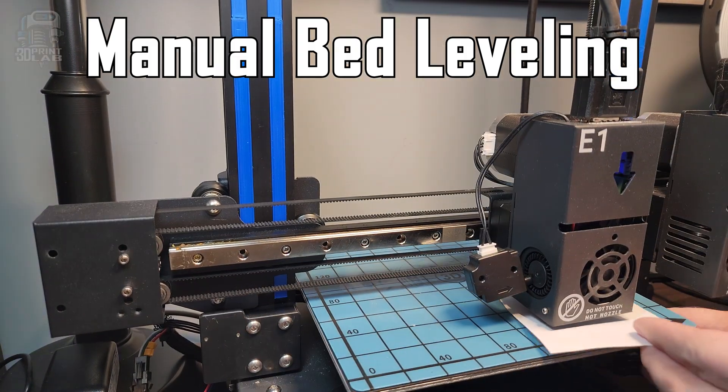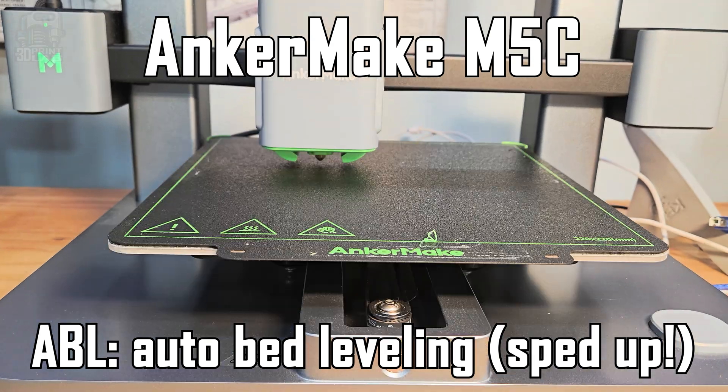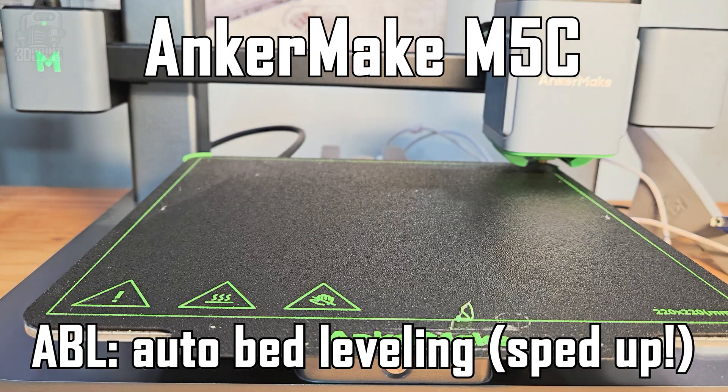You may have heard about bed leveling and the nightmares of leveling with a piece of paper and turning knobs — not something I'll really want to go back to. Most printers now have built-in ABL, or automatic bed leveling. You probably have the option to do a short version of this every time you print, and it's probably a good thing to let it go ahead and do. You'll know your printer's leveling when the nozzle goes around the bed and touches different points a few times before it moves on. Running a full ABL calibration is usually part of the full calibration test, but you can usually do a full one if you have some issues — and this is a good first thing to do if you're having consistent problems with a print, after you clean your build plate really well.